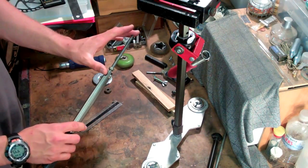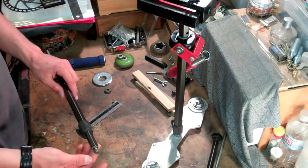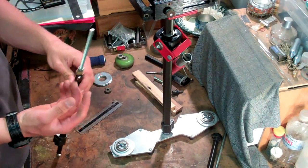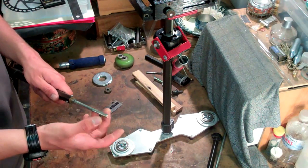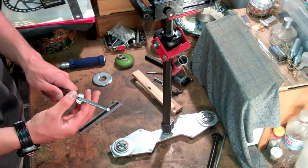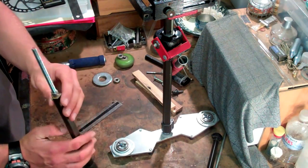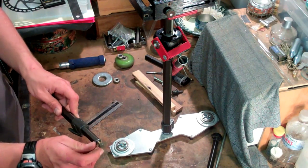For the ends of the shaft, you'll need to insert a bolt piece on either side. Use some epoxy or another method to fasten a 3/8-inch bolt — 3/8-inch because that fits best with the bearings. You want about 5 inches of bolt, and make sure it's perfectly straight in both directions. Leave about a half inch to three-quarters of an inch exposed.